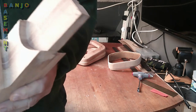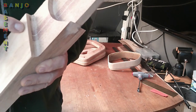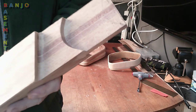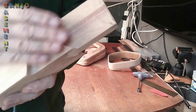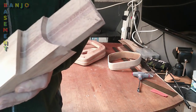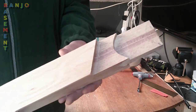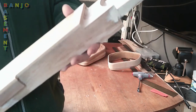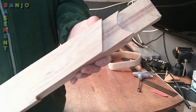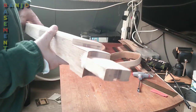I've now sawn the angle and the fretting scoop, which I think is probably a mistake if I'm thinking about planing it, because now I'm in danger of chipping the edge. Whereas if I'd left it long, done my planing, and then cut it, that might have been a lot more sensible. I don't do this every day of the week. I'm going to get some more work done on it — I just couldn't resist it. At least I've made a reasonable job of it such as it is at the moment.